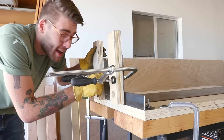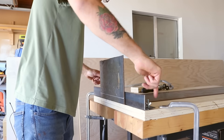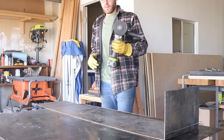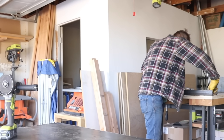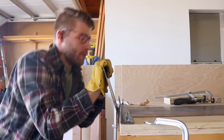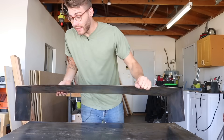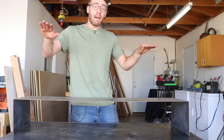There we go — not bad for a first try. I'm going to try cutting a little bit deeper of a groove this time. Instead of cutting halfway through my metal, I cut close to two thirds of the way through my stock. I also took a little bit longer with my grinding wheel to make a wider bevel so that there was less material to get in the way of my piece bending. That second one was a lot easier — I don't think it was so much the deeper groove, it was more that I did a more dramatic bevel on each of the edges.